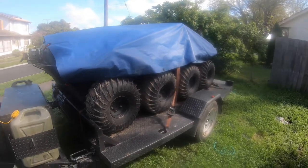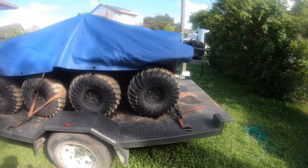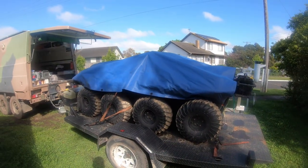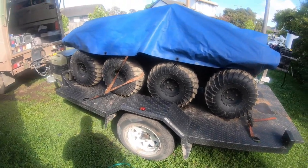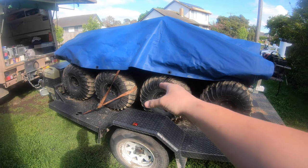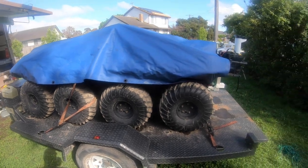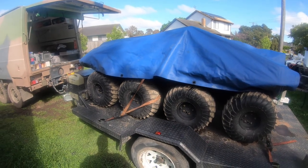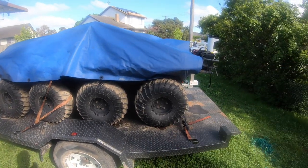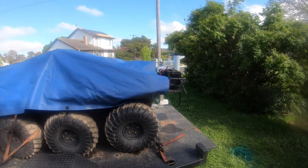It's the start of another video and there's been a bit of a gap — I've failed at a couple of recordings. I'm basically doing the bare minimum today. This had a run up a sandy beach area, so there's a lot of sand on it. We also did some water crossing, which means I need to put grease in the outer bearings — I've been neglecting that, and it's bad for an Argo. We're also going to pull the battery out of the back so it doesn't permanently warp the tub.